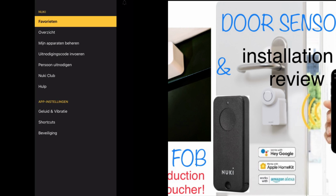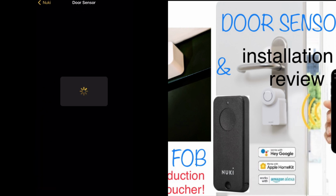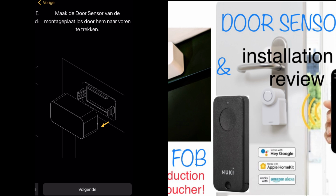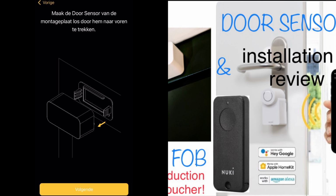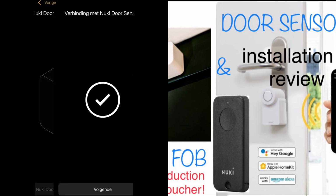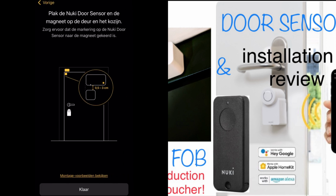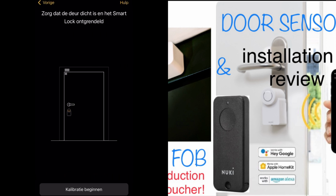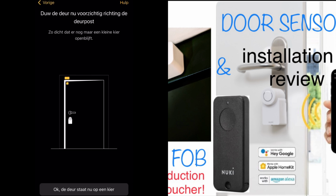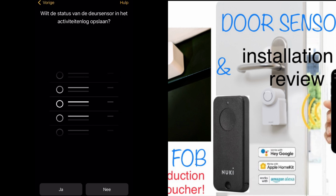So now set up, we have to add the door sensor in the Nuki app. So we go to our device, add the door sensor, and it asks is it already mounted. So remove it from the socket and press the button to synchronize with the Bluetooth connection. Once it is done, the app confirms it's okay. We can place the door sensor back on its mount and start the calibration. For this we open the door to its maximum, very slowly, and when it's done we push on the button. And then we have to almost close the door and push on the button again to finalize the synchronization.